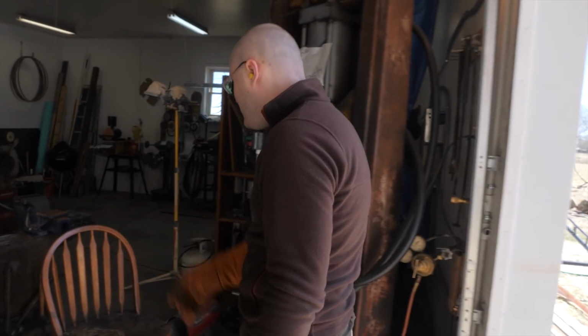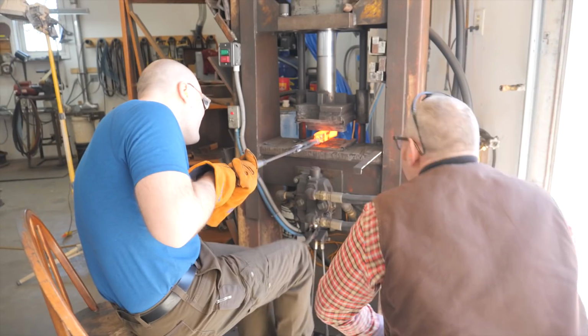I'm not even going to force it out too much more, and then go ahead and hot cut it, and we'll start folding it up and doubling the layers. We've got 23, so next we'll have 46 and then 92. I don't know if we'll leave it at that or maybe go one more and have just shy of 200.